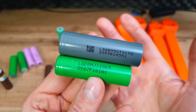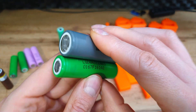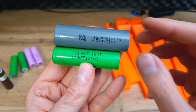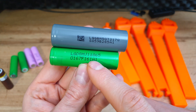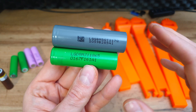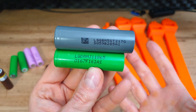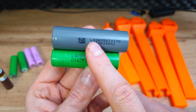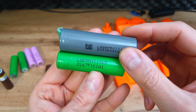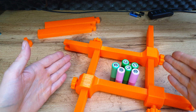Overall I would go with repack 18650 or 21700 cells. For me the answer is simple: 21700. They are a little bigger but have bigger capacity. Most importantly, the lifespan of 21700 is two to four times greater compared to 18650 — that's why Tesla uses them. If you make a battery pack with an LG 18650, it might survive two years. With an LG 21700, it could last four to six years. They are a bit pricey, but that's the cost for lifespan and fewer problems.